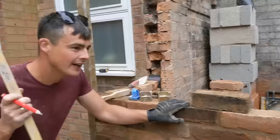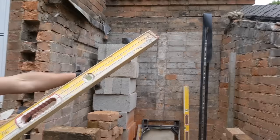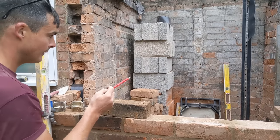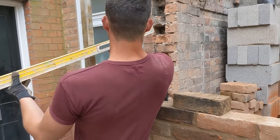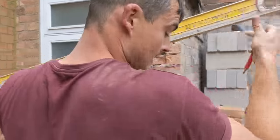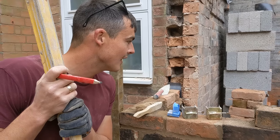Good morning — we're back at the extension. Yesterday we had a late start and didn't get as much done as I wanted. It's just gone ten past eight so I'm just getting set up for the day. Drew's throwing a mix on. I've set profiles there, there, and one over there. In a bit I'm going to roll out some 300mm tray on that garden wall to prevent damp coming into the brickwork. I'm also getting some ties in so I can tie into that corner to keep it strong. Right now I'm transferring my levels across from this brickwork over to there and over there, so when I pull through all I've got to do is level from there to there.